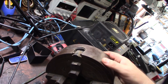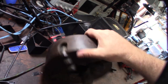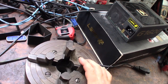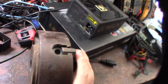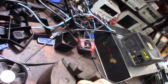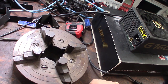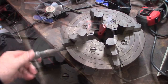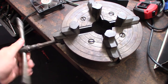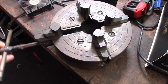I just want to go through this thing and clean it up. I'm soaking it in vinegar and salt to get the rust off, then degrease it — the same thing I did with the other chuck I restored. The jaws should be numbered. I got number one right here, so I just need to make sure I get them back in the right orientation. I'm hoping this one's number two.